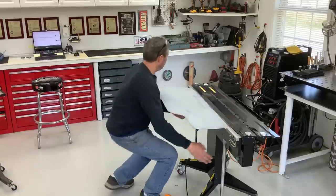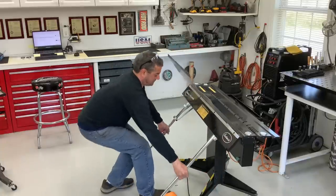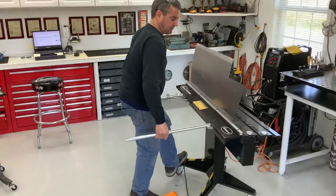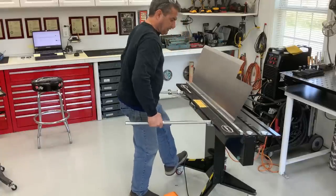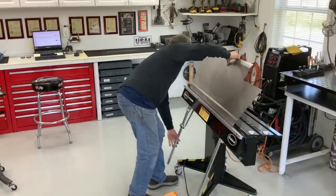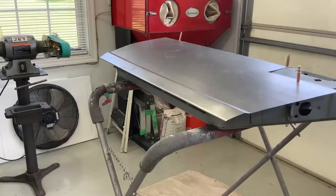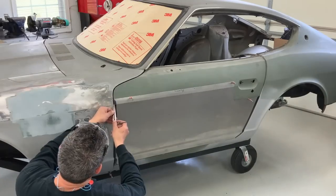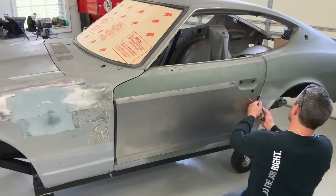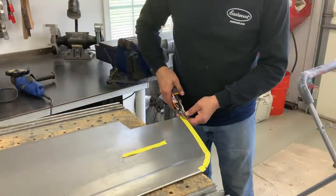Here I'm adding a half-inch bend which will actually be folded and crimped around the door frame. With the door off the vehicle we did a quick test fit again, and with a set of dividers I marked the 3/16 gap that we want on the new skin, once the skin is trimmed to shape and reinstalled back on the door to do our final cut.